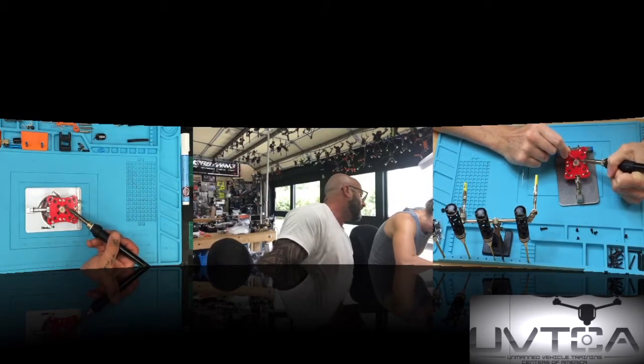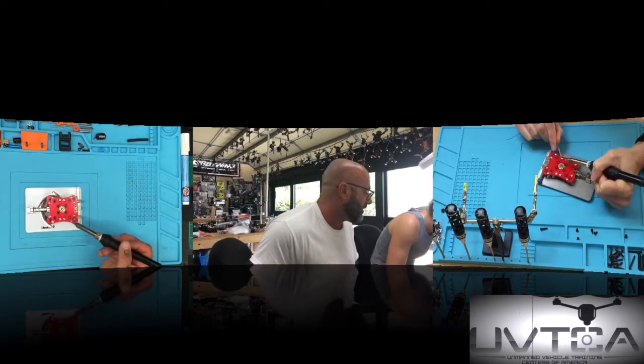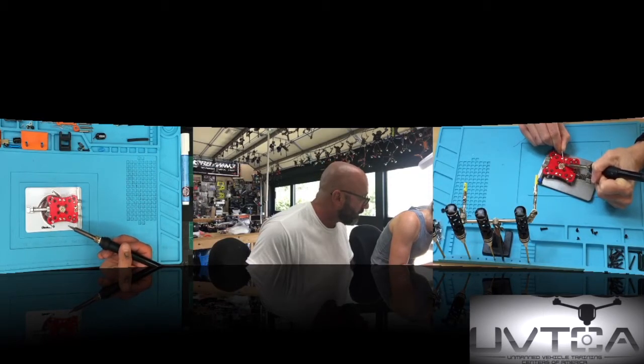No, don't tap it. Run it. Like, run the soldering iron along the circle itself. You don't have to lift it off. Just run it quickly, like take it down the track. Just keep it pressed down and run the iron. There you go.